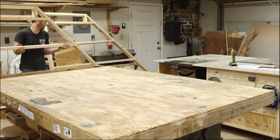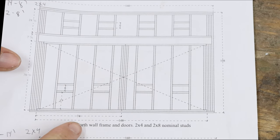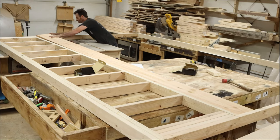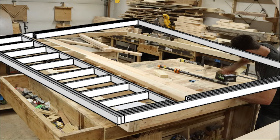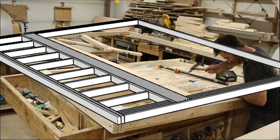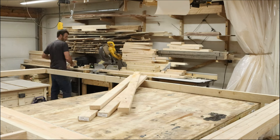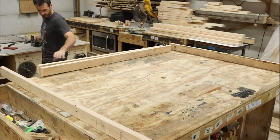Don't forget, you have to make two of these. The next piece we need to make is the front of the kiln, which is a bit more complicated because we have a header to work with. I accidentally bought a 2x10 rather than two 2x8s, so that's what I ended up installing. The way this section is supposed to fit together is you put down one of the 2x8s, then a half-inch piece of plywood the same size, then another 2x8, and everything gets nailed together. Because I used the 2x10, my doors ended up a bit shorter than designed, so make sure you buy the right materials.